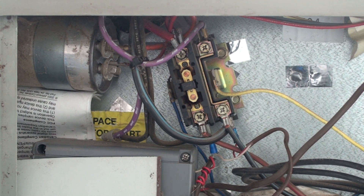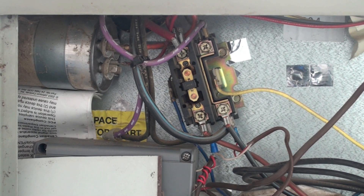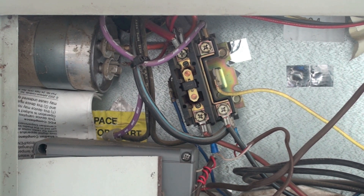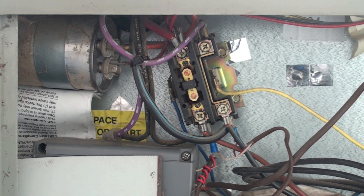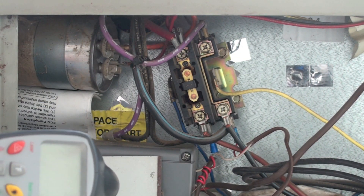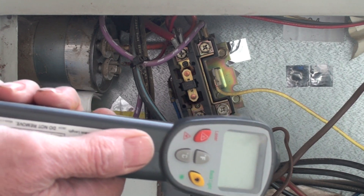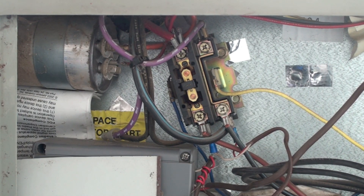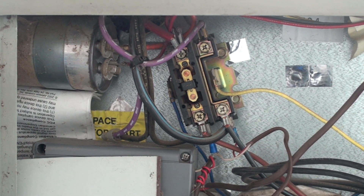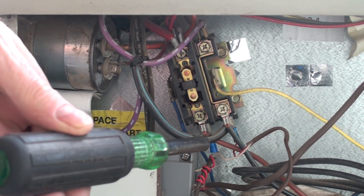This should be a part of any service — pre-winter, pre-summer — where I have high-load contacts that have a lot of amperage going through them. I should be doing this kind of check. These things have a pretty good use for just that: checking temperature. I would use these on pretty much every job I go on — it's a very quick way to find out if there is any potential problem.